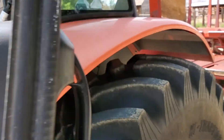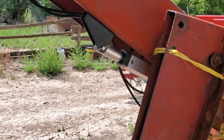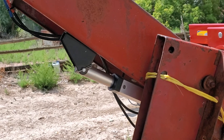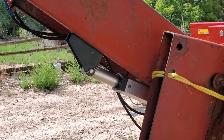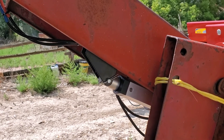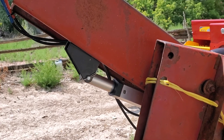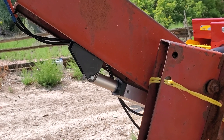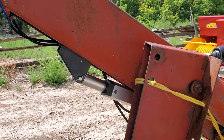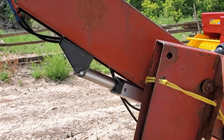Now I'm going to show how the joystick controls the linear actuator. My son is going to move the joystick and we're going to watch it respond — moving it forward a little, then back, then back as fast as he can, then forward again. You can see it's pretty fast. It's plenty fast enough to operate the pickup. Right now we have the tractor powered off and this is being powered through the 12-volt cigarette lighter — we'll show how it works when the tractor is running.